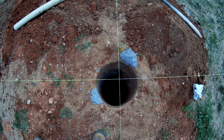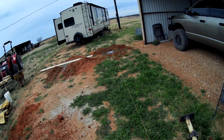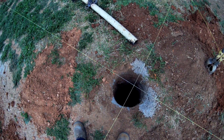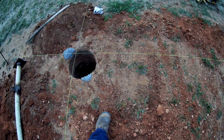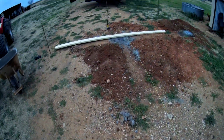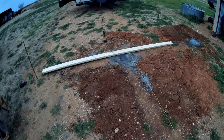So last night I just went ahead and mixed up a bag and poured one in the bottom of these remaining three holes. I figured it would give me a base layer to build off of for levelness, and it'll act kind of as a plug or a plunger — something dense that has to get pushed down first. To me, all of this force is just going to be downward force unless we get smashed by a tornado, which I feel is highly unlikely.